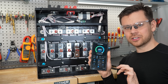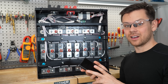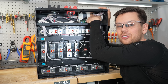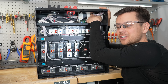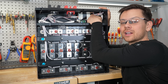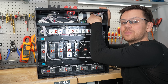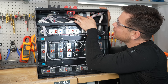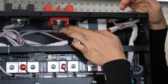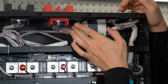I think the colors they use in the marketing materials, and also the case, look very good — I think they're doing that right. You just need a better name, honestly. Now, the connections to the circuit breaker have no ferrules, but they glued it — I've never seen that before. I'm not sure if I like it or dislike it. Terminals on these breakers have temperature ratings, and adding an insulative material like glue is not a good idea in my opinion. Also, the screen is powered with a non-fused conductor. As long as it's in the case it's okay, but I don't like it on the main terminal like that — having a small inline fuse would be preferable.